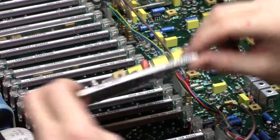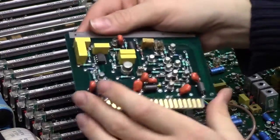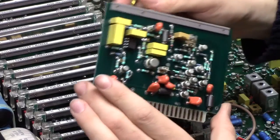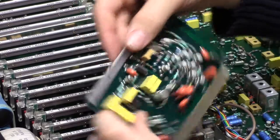Signal adder. Not too much going on there — mostly passives and more metal can transistors. 2N3209s for the most part. And a little 741 op-amp hiding in the corner there.